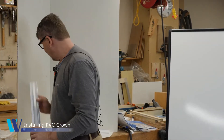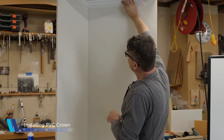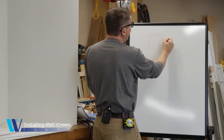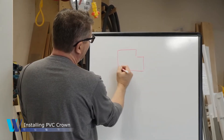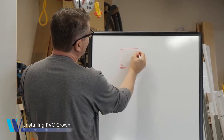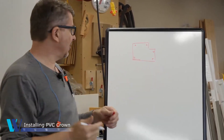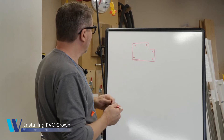The thing about this technique is that you do have a true butt joint in the build. If you have a room that looks like this, you would have a butt joint here and then a coped joint here. So in this room, you're only going to have to create five cope joints. It's not like with the miters where you have to have two joints per corner, and of course the outside corner wouldn't require one.